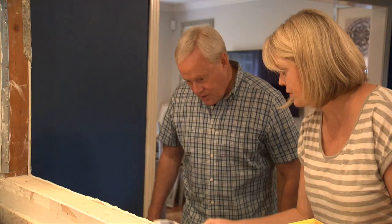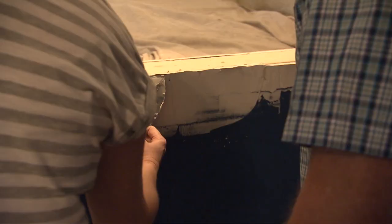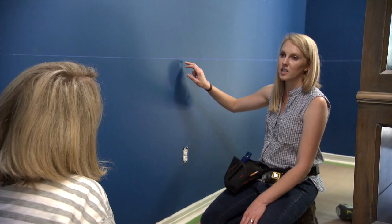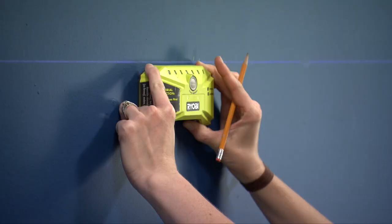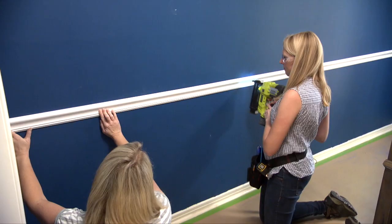LiDale's work ethic earns her a standing job offer. While Danny finishes the drywall repair, Chelsea gets started laying out the chair rail. To nail the chair rail into the studs behind the wall, it helps to mark them first — a stud finder makes that easier. A corner piece goes in below the line and the nail gun is ready to go.